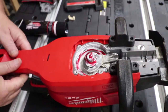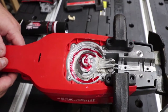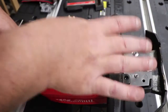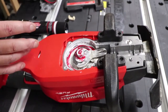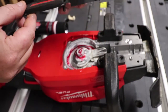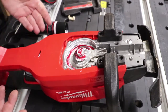This much is really all you need — it doesn't take a lot, though you could put a little bit more if you wanted. You don't want to fill it completely up because you'll start getting gunk running out the end when you're using it. Another great reason to take this apart is that debris sometimes gets shoved back in here underneath the casing, so you can clean all that out as well. Keeping your hedge trimmers properly maintained is a great practice.